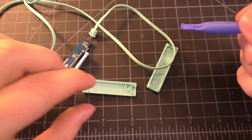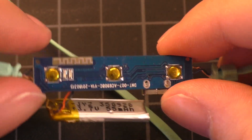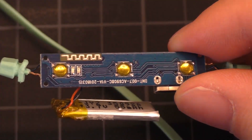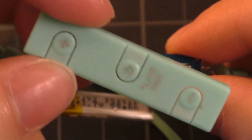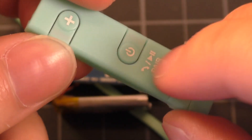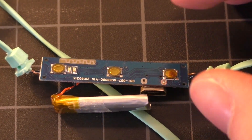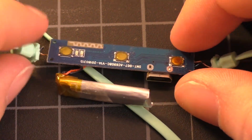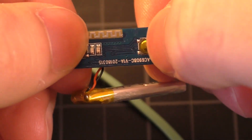That wasn't held in very tightly at all. So on this side of the board, not a whole lot. We've got a red and a blue LED and three buttons — there's the power button, which is also play, pause, and pairing. And then you've just got volume up and down keys. So that's fairly simple, fairly standard. They're just these little tactile dome-type switches.